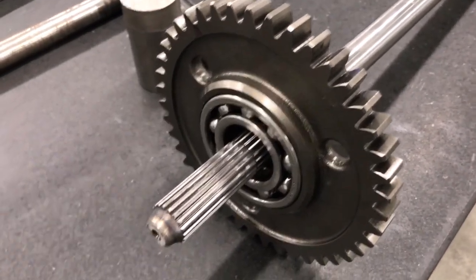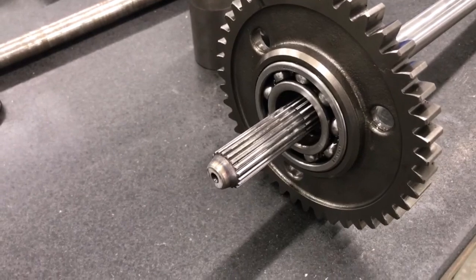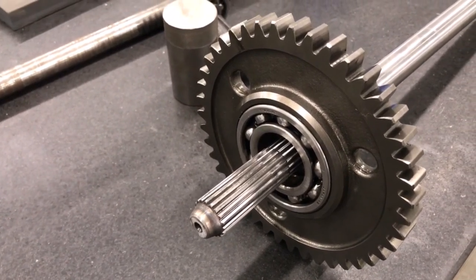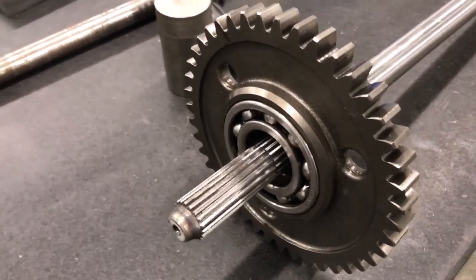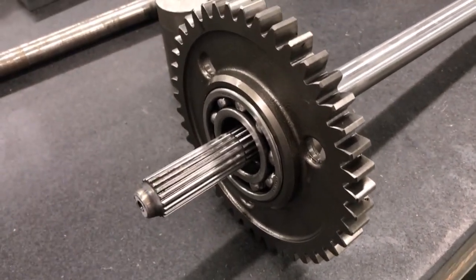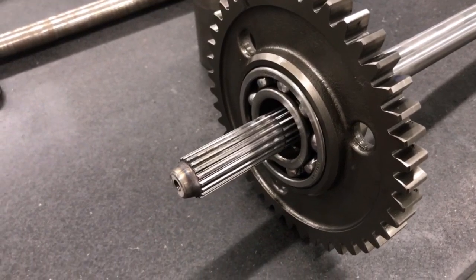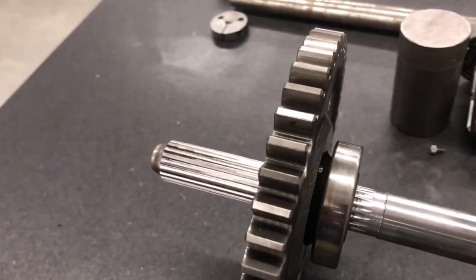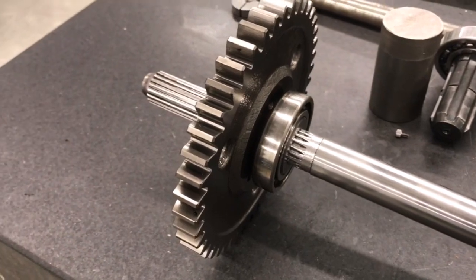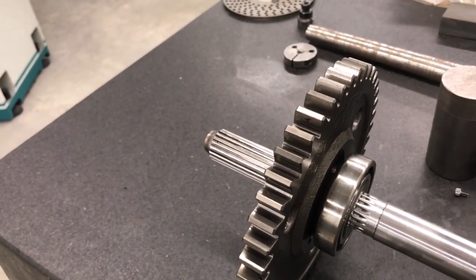I am done on the dividing head and ready to move on to reworking this end of the shaft, which is going to be a little bit of a challenge. This is a Rockwell 56C shaft, so I'm having to work it with some carbide tooling and hope for the best because I don't have any ceramic tooling. A note about ceramic tooling: interrupted cuts like this are a nightmare with carbide, but with ceramic they're really a nightmare. I'm trying to get the best I can and work it out. Overall, what I set out to do is done. I'm Derek Hogan with North Georgia Technical College — if you have any questions or anything you'd like to see, put it in the comments, and don't forget to like and subscribe. Thanks for your time.